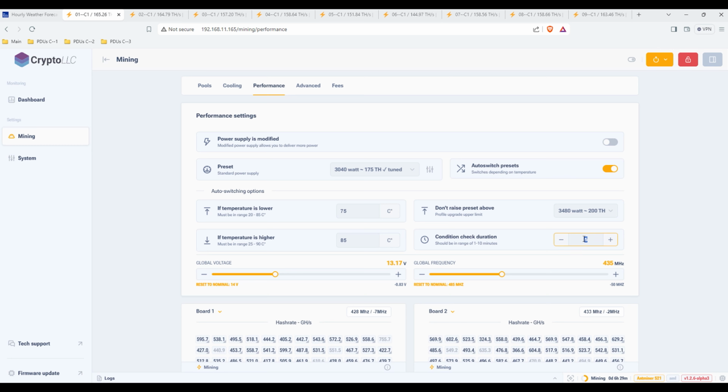And by the time the miner tries to do a check on it, which is every 5 minutes, the miner overheats because you're telling it to go full blast after a restart. The miner will say overheat error because it doesn't have enough time to do the check, which is every 5 minutes. So it's just going to restart, restart, restart, restart.